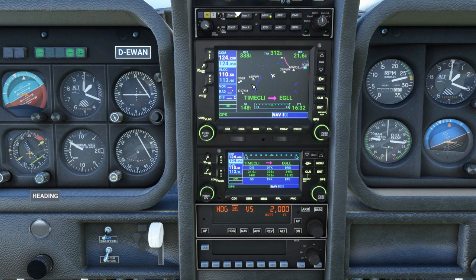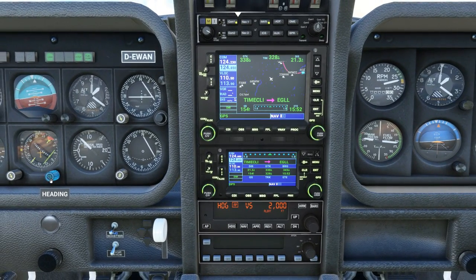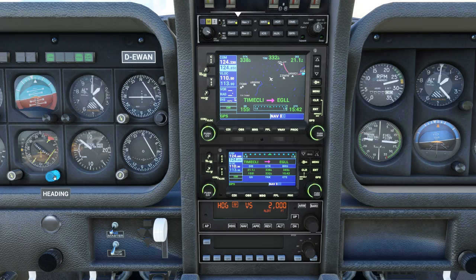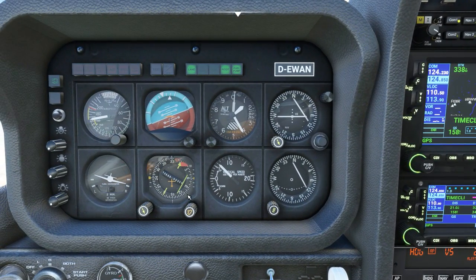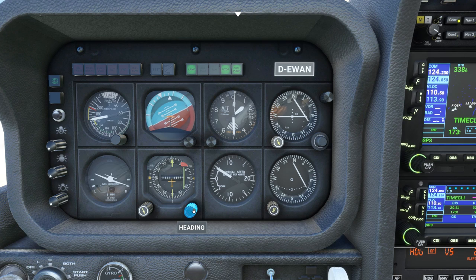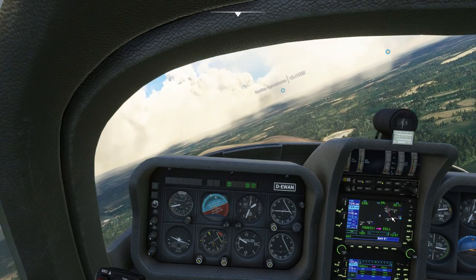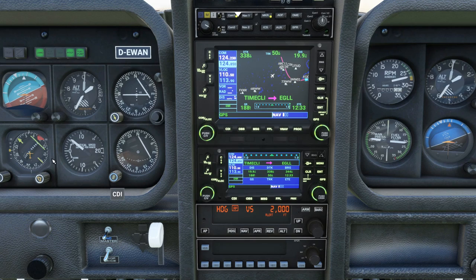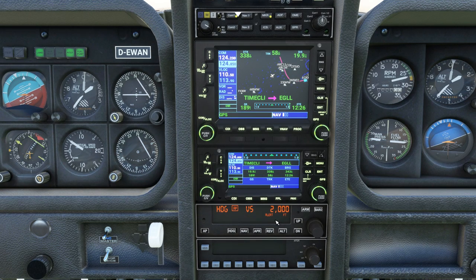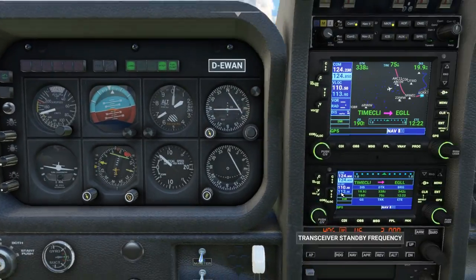To change the heading in the Trinidad you move this knob — I want to go in an easterly direction to get back towards our flight plan. I'm going to adjust the heading bug back towards an easterly direction, and the aircraft is responding. You can see it's turning back towards our flight plan. That shows how the heading mode in autopilot and vertical speed work slightly differently to something like the Cessna 172.